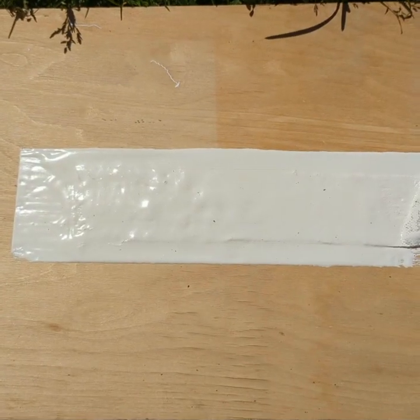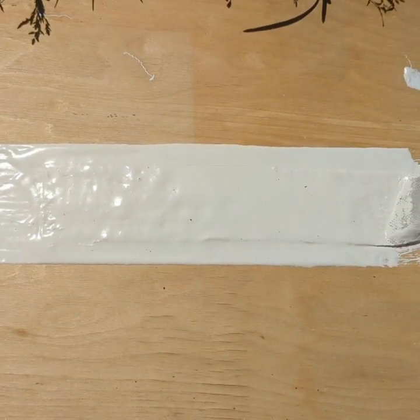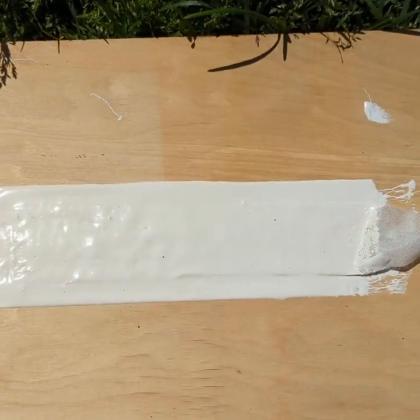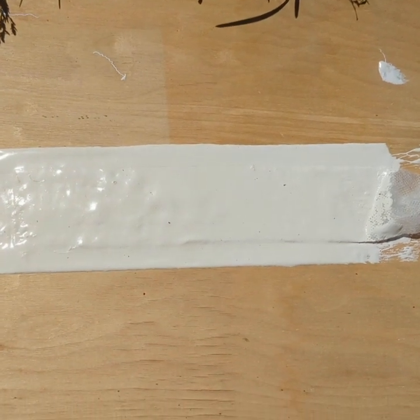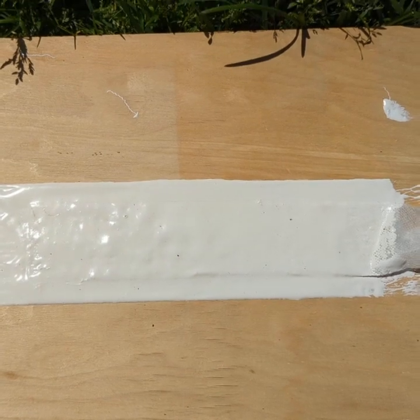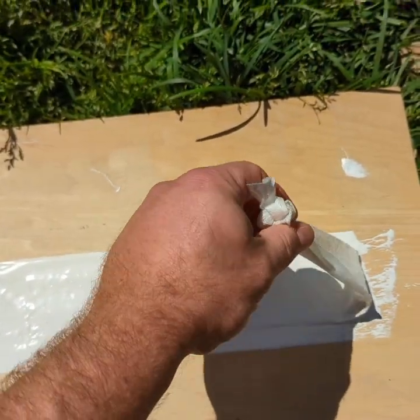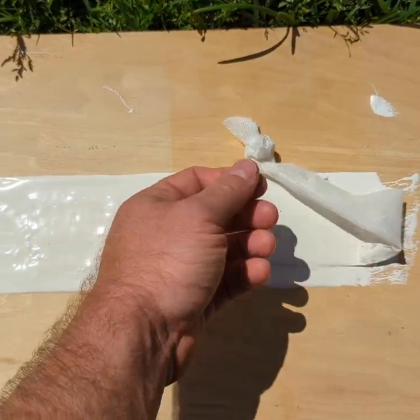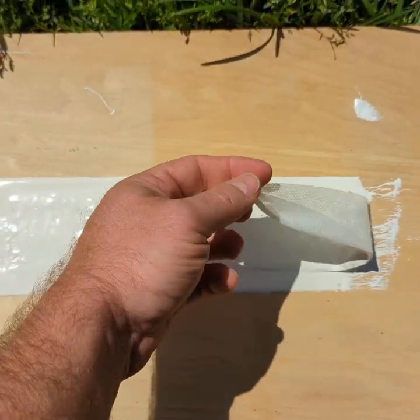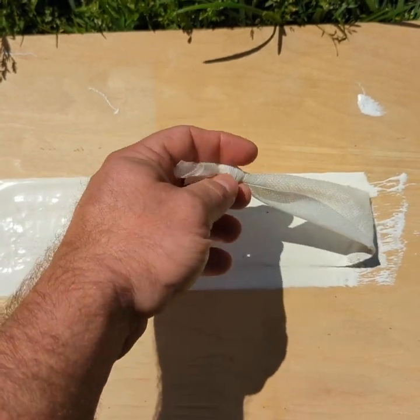And now this is the part where there is a lot of confusion out there, and that is the direction or the angle that you pull the test at. Now I don't have a fish scale with me, so just pretend that I've got a fish scale hooked to the end of this knot here. The important thing for me to explain here is the direction that you pull it. You want to pull the test at a 45-degree angle.